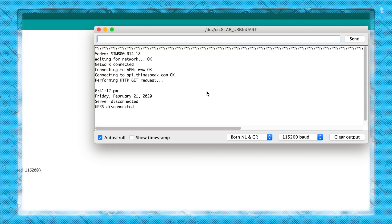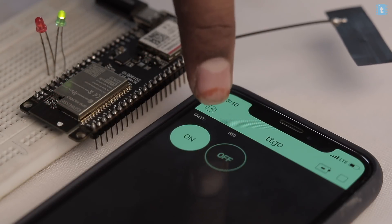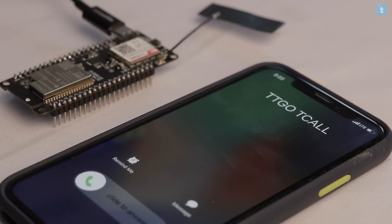That was a simple example. Now let me talk about the projects you can make with this module. First, I made a real-time date and time project that fetches the time and date for India from a website using an API — useful for a world clock or internet-connected weather station without Wi-Fi limitations. This module also works with the Blynk IoT platform, so you can control Blynk projects without a Wi-Fi router. Here I'm controlling LEDs connected to the module via the Blynk app on my phone, with data transferred through GPRS — no Wi-Fi, no Bluetooth. You can also send SMS to the device, make phone calls, and there are tons of other projects possible.